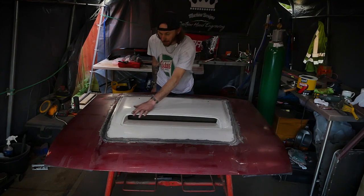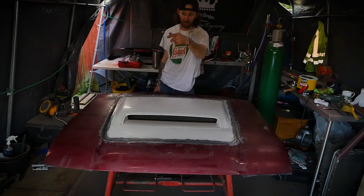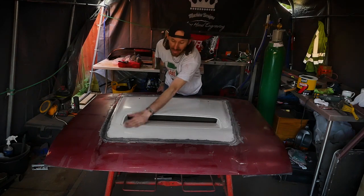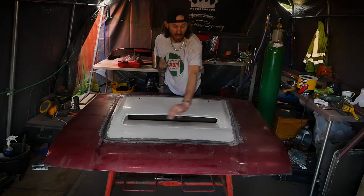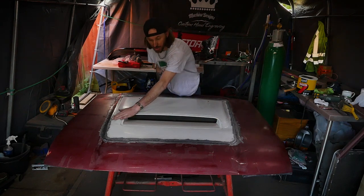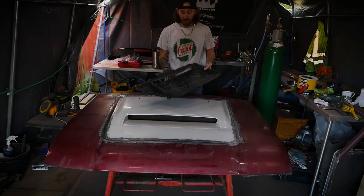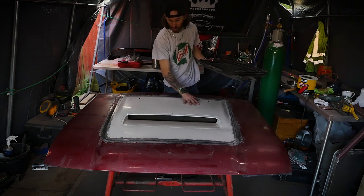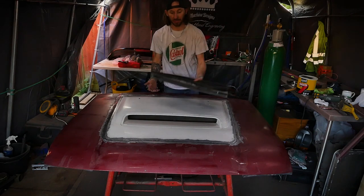The physical scoop is in. Has come up really well, so that's bolted to the factory mounts from the 79 series bonnet. I actually bolted that through so it doesn't move. What we had originally was a couple of flex points over there and there, basically this lifted up. So adding that bracket in there has brought it down, and made it all streamlined, which is really good. So I can fit the factory scoop if I wanted to. I just add the rear frame to the internal part here. So I can slide that in, tack weld that, and that can basically bolt in if I wanted to.